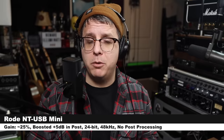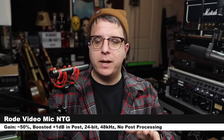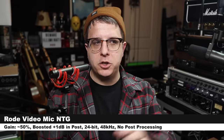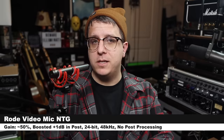How many of these are we going to do? Now I am speaking into the Rode VideoMic NTG, running it over USB directly to my Mac. I do have the 20 decibel pad engaged, and my gain is set at around 50%, and this is how it sounds when I'm 3 inches off of this microphone.